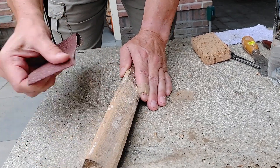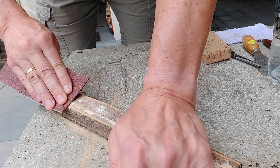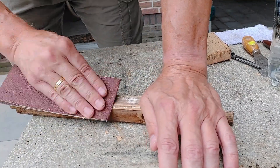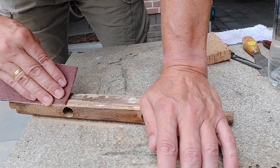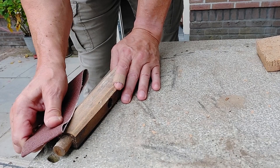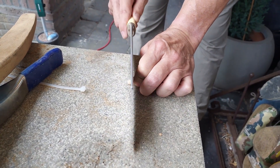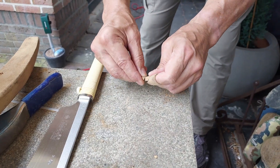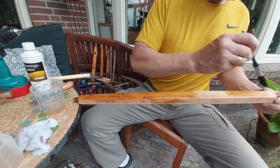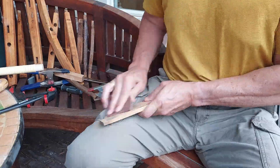Here I am sanding. This is the start of me sanding this chair — probably five times, and I don't want to exaggerate, but I did it five times. Part of it is just sanding down some of the work you did, but I also went over the entire chair. Part of the sanding is getting the glue off the ends of the spindles. Here I am cutting a dowel to plug a hole — probably from where the nails were. I just had to drill them out to make it look nicer. Here I'm putting oxalic acid on all the wood, and that takes out stains.